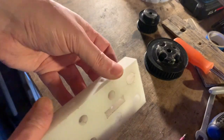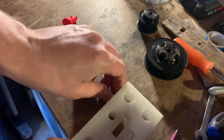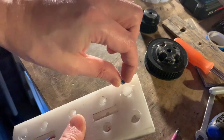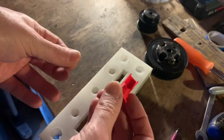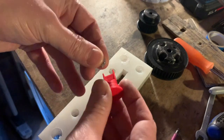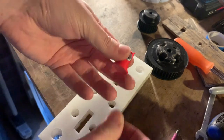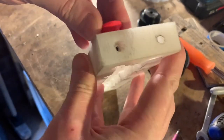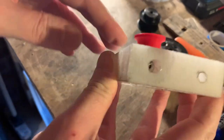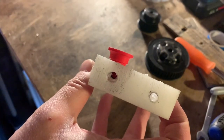Here's the rear of the robot. Into these we have some locking nuts, but actually getting them in is quite painful because positioning them is just a nightmare. So instead we made this little tool — you put the nut into it, which then slots into the hole in the rear, allowing you to put the bolt through while keeping the nut in position quite easily.